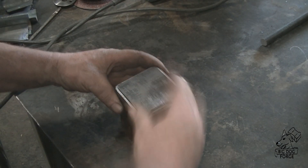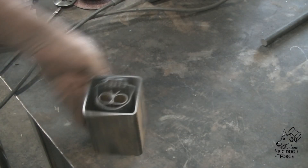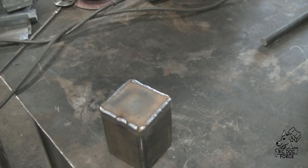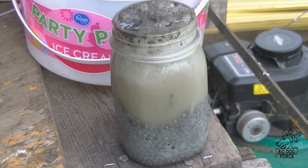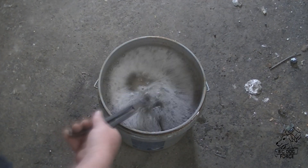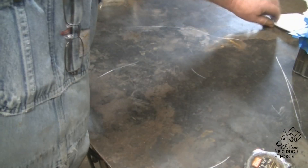We're going to line it up, tacking it in the corners. The material we put in the empty spaces should hold everything in alignment while forging. We've got plenty of room on that base plate — we'll put some good welds on it. We put some muriatic acid in to clean it all up. These are BBs and we soaked them in muriatic acid to get the zinc off the outside. I had a subscriber asking if we'd ever done anything with BBs and we hadn't, so we're going to try some with this skull.